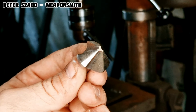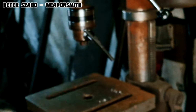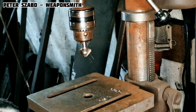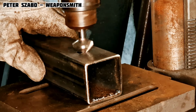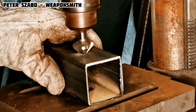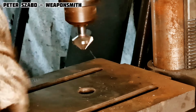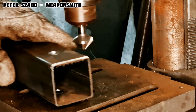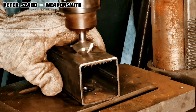After drilling, when all the holes have the correct size, you need to use the tool that removes the sharp edges. Again, it has at least two advantages. The first is safety. You know, sharp edges can injure you. The second advantage is the simple assembly of the elements. The sharp edges are not above the surface of the material and therefore do not interfere.